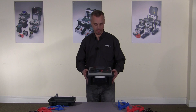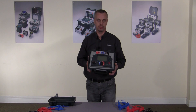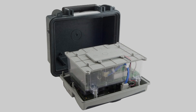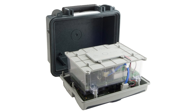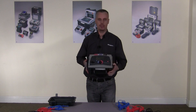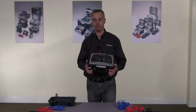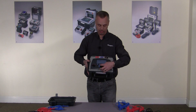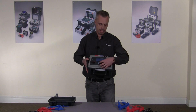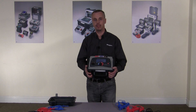It's small and lightweight, making it easy to carry and easy to store. It's also fitted with lithium-ion battery technology, which means it can be charged in two hours flat. It's tough — it's got dual case construction. The inner case gives you the fire retardancy and protection, but the outer case gives you the toughness and the ability to take the knocks and impacts of everyday life. It's also noise immune, with a full 3 milliamp of noise immunity, making it ideal for substation environments. In addition, we have a voltage measuring range which can measure up to 660 volts and also can measure frequency. We have full data storage and download via USB, and all the test results are date and time stamped.